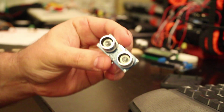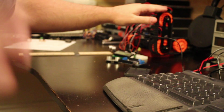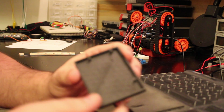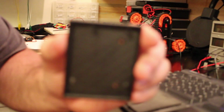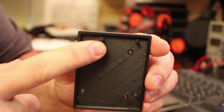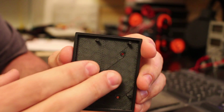And as in the first video, we will use the same ultrasonic sensor, which is the HC-SR04, to detect basically the distance. Because I'm using a metal chassis of the tank, which I can post the link to buy it from SparkFun, I printed a small 3D base for it with 3 pegs, let me zoom in, that can connect to the Arduino holes, and that way you can hold it in place. So now the Arduino will be safe from any metal contact on the bottom.